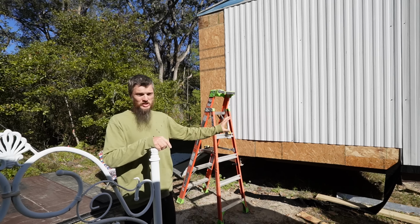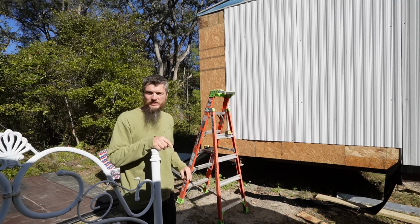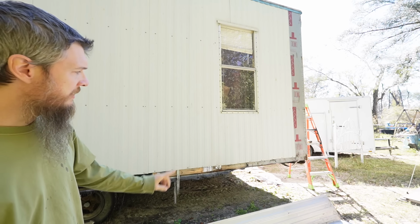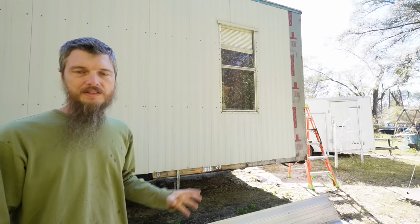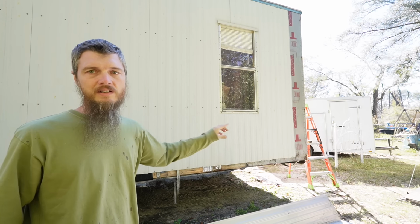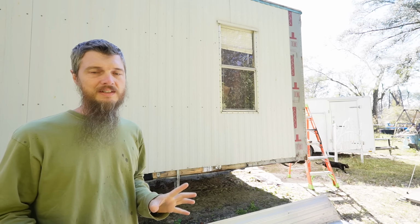I've been reading the suggestions about this wall and some good ones, and I'm not sure what I want to do yet. But we do know what to do back here, so that's where we're going to be working right now. We're going to take off these two panels, take out the window. This window's staying, but what we want to do is just fix the rim joist down here and then reset the window with new butyl tape to make sure it's going to last and not leak.